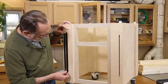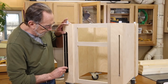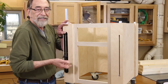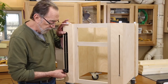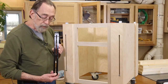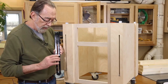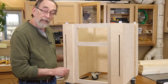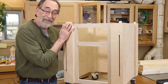Basically it will go on just like this — it gets screwed into the leg, then the knob goes on. When you raise up the table you'll be locking that knob into a piece of steel. I just kind of thought it dressed it up a little bit. You don't have to do this, but I will put the drawing in with the other documentation you can download from my website. If you have them cut out with the groove, and then do the holes and chamfers yourself, it would probably be pretty inexpensive. I need to let these sit overnight, so the next thing we're going to do is get started on the two tops.